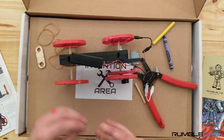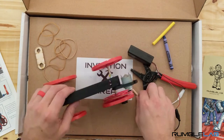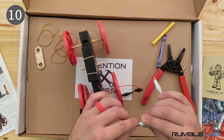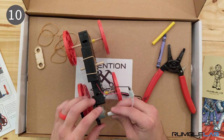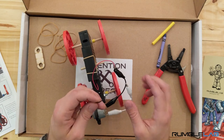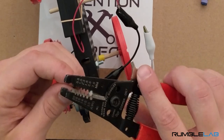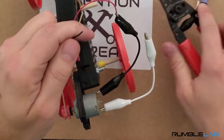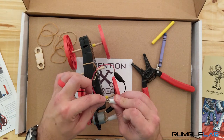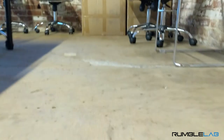There are a couple of ways to mount the battery pack. The first way is to put a rubber band around the car to hold the battery pack in place, but the way we like better is using a dowel and looping a rubber band over both sides. The last thing we need to do is hook up the motor — hook one wire of the battery up to one wire of the motor. If the end of the wire broke, you'll need to restrip it: clamp the wire in the right notch of the wire strippers and pull. Many people twist the end of the wire to keep it from fraying. Then hook your connection back up and you're ready to rock and roll.